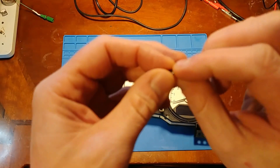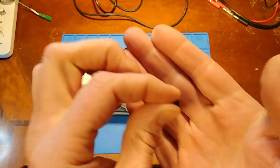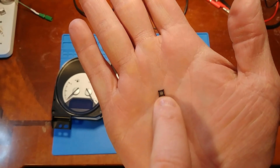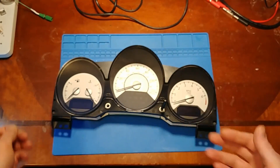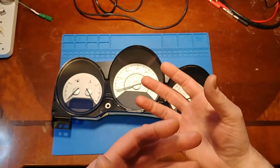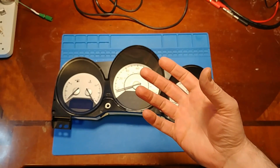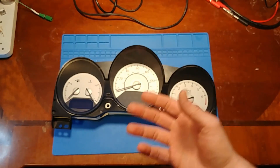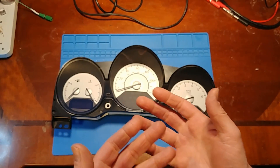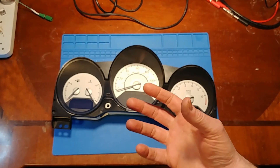And here is the old chip that was pulled. Like I was kind of expecting, that heat sink pad in the middle just didn't look like it was doing a good job at pulling the heat through. It just had some dried up, lead-free, nasty, crusty solder. And I believe that's probably why these are failing — it's just not able to pull the heat through.